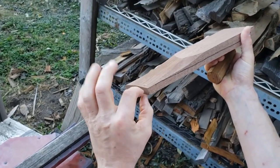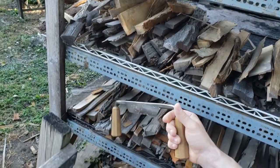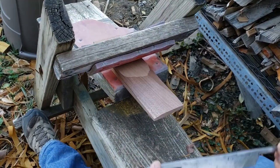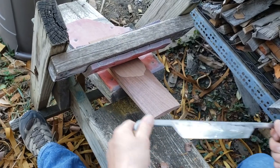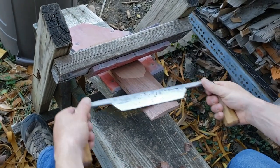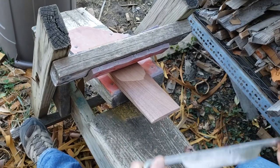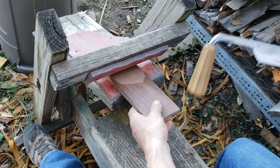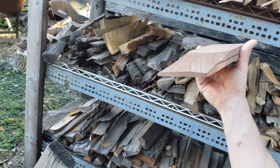Here's what I have so far. I'm going to stop when I have less than a quarter inch thickness left at the leading edge. Notice as I work from one side over to the other, the skew and slice gradually changes. With enough experience it becomes automatic — you're just on autopilot. That's tapered down to about a quarter inch; it doesn't need to be real consistent yet.